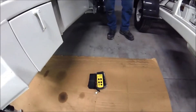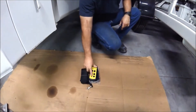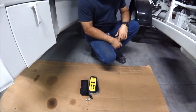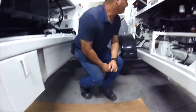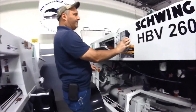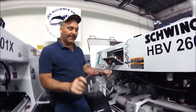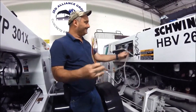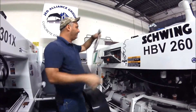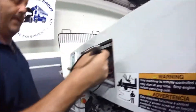And then you've got the transmitter. They usually come with batteries in them already. You can turn them on, check that it's good. You can do this after you install it. So now that the receiver is in the machine and you've drilled a 3/8 hole and you run your wire, your pigtail, into the machine, you just want to test for power. Usually I grab power off of the power meter.